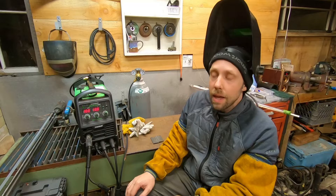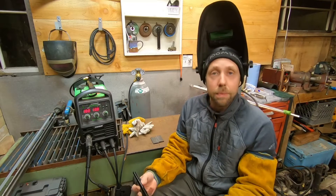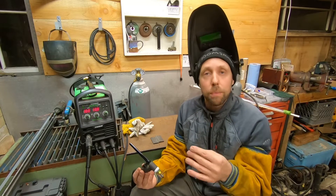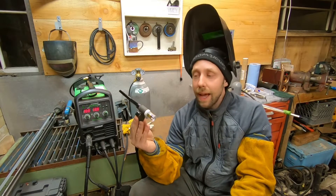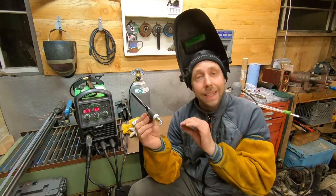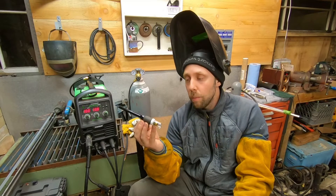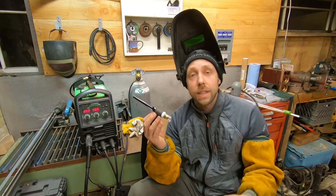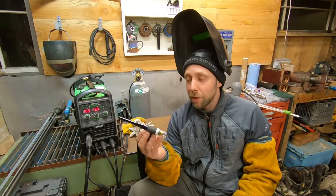It's been a slow learning curve with TIG welding. Even when I was using the original cups, I didn't think I was contaminating the tip from dipping it, but I was realizing it was causing bad gas coverage and causing the metal to kind of boil and bubble and get on the tip. With the Pyrex cup, not only can you see better, you can use less gas — it just seemed like a way easier time. You're getting cleaner welds. I never had really clean welds before with the old pink ceramic cups. My recommendation: shuck those things and just buy a $20 kit like this.